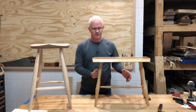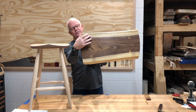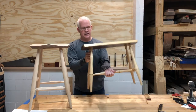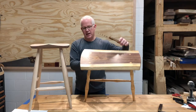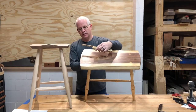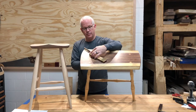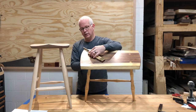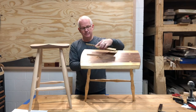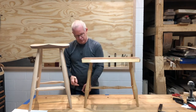It's a little easier to see on these little live edge stools. I made the decision based on grain where I wanted to fall on the color change and where the dimensions of the top fall. I measured out to my edge — I decided I wanted to be in four inches, and coming this way these were falling about three inches in. So that's where I need them to fall on all the corners. Then I take those two points and go out to the corner, and before I trimmed it was out about five, five and a half inches. So I know I have to travel five and a half inches out from the bottom of the hole to where the foot lands.